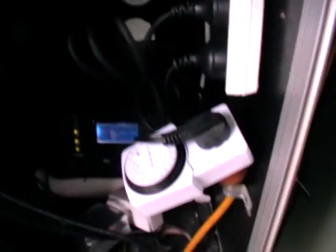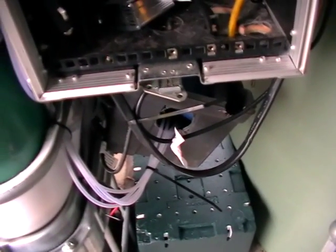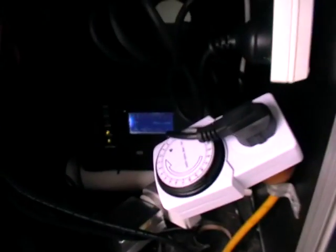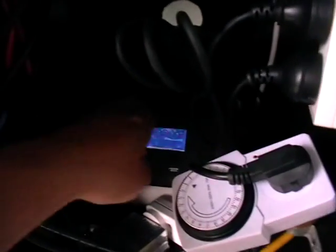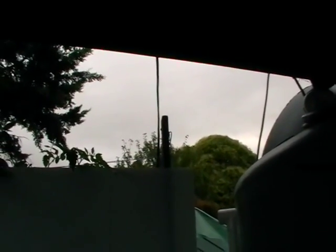It's probably slight overkill. The wattage on those air pumps is 35 and 10 watts — so 45 watts total — and that runs them day and night with that controller, the 90 amp-hour battery, and about a 100 watt solar panel. The panels are up on the roof over there. The other side of the system runs all the pumps, with this larger controller which is a little more high-tech and gives you readouts of everything. Even on a pretty cloudy day after 40 degrees-plus yesterday, you can see it's gone down to 14 degrees this morning.